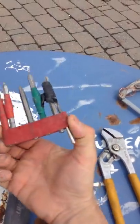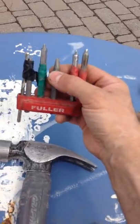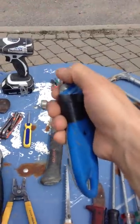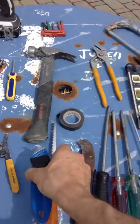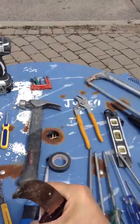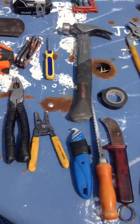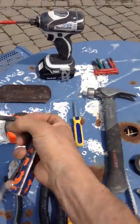Have a little carry-all with your bits — red Robertson, green Robertson, star bits — taped up for easy access. For knives, you need an exacto knife with a hook blade to strip Romex. It's very sharp, so be careful. I usually strip down the middle of the sheath — just a matter of practice with the exacto knife.